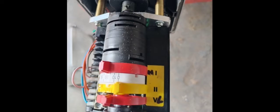This is very important. We've got positions one, two, and five. Position five represents low fire — this is how much air we're going to let in on low fire. You can use the screws on here; position two is the off position, and position one is high fire. If I make my adjustments on here you can see that in the off position we have no air going in, but in high fire the manufacturer preset is at 30.